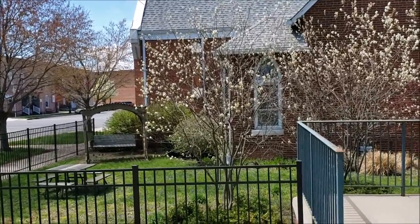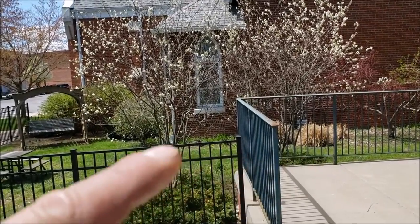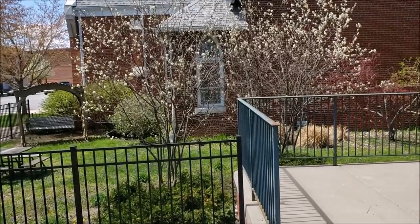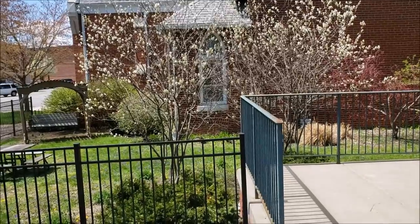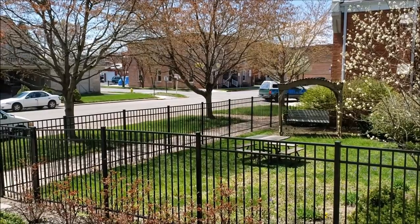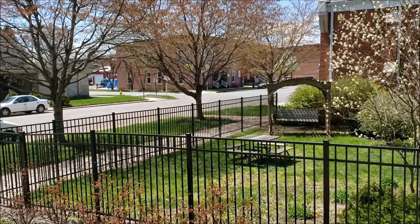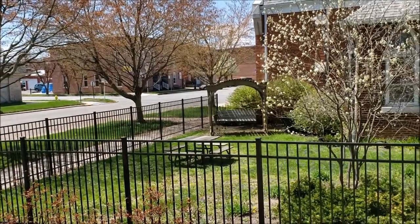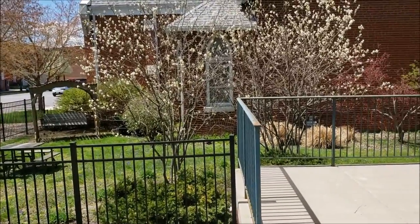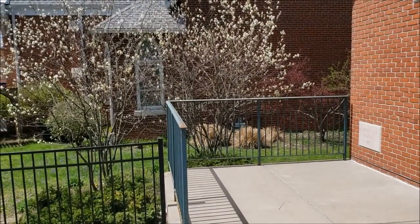You can see by the bench right over there, that corner takes a lot of water. You can see how big the roof is, but it's washing out and settling — the foundation's settling. So we're going to try and get some drainage going in there. We'll put a trunk line down the middle and tie in each downspout to about a six-inch main line, going from four to six inches, and take it over to the street and tie into the water runoff drains.